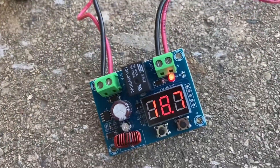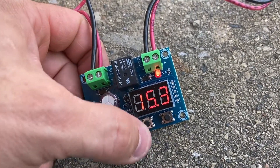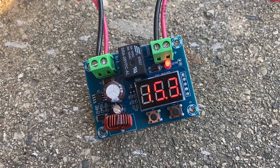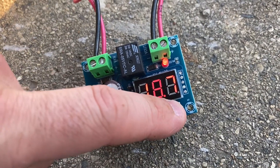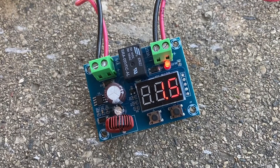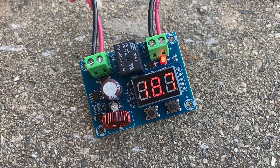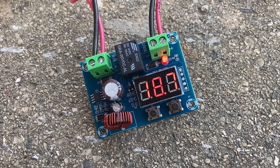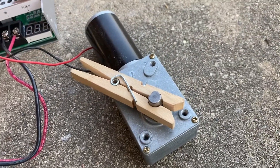Here I've got another battery pack with 18.7 volts, almost fully charged. I've set the low voltage threshold to 15.3 volts — that's where I'm comfortable with my packs. The differential is still set to 1.5 volts, so once the circuitry triggers, it's going to go back up to 16.8 volts before it'll close the circuit again. That little LED indicator tells us that it's allowing power through the system. So let's turn on our gear motor and let it drain the battery.